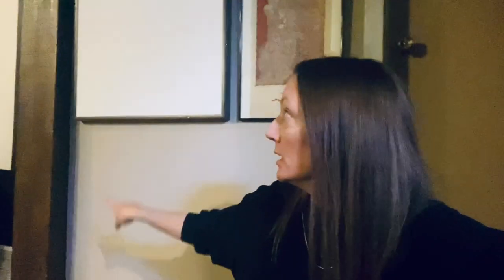My only concern is I don't want my gel stain to look very shiny. I want it to look more natural, a muted color. On this beam right here, you can see it's kind of shiny because of the lighting in this basement. It reflects onto the beam and makes it look really shiny, and I want to bring that down. So if it does end up shiny like this, I will take a matte polyurethane at the end of this and hopefully bring that shininess down.